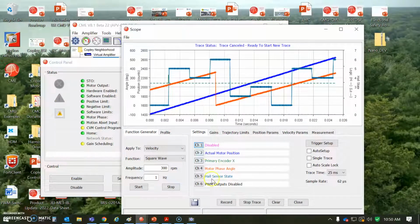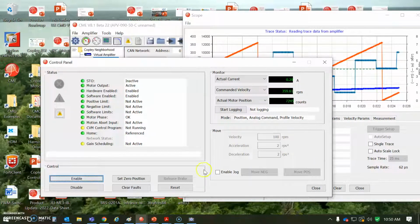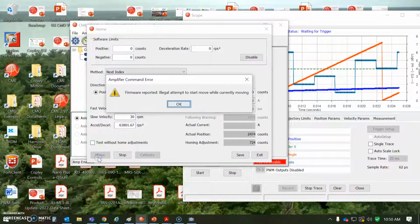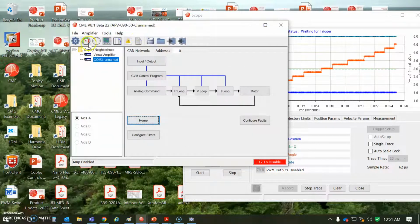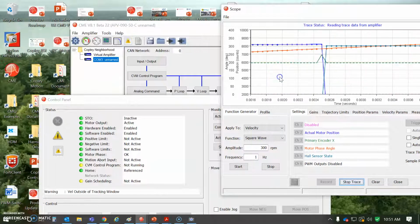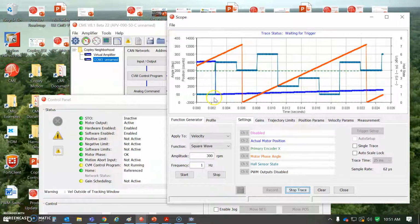And again, I've been tracking the index pulse. So right now it's working from the 0 position, which is good. And so for the troubleshooting of the index, what I do is I do the homing, and I'm going to have to do this twice, but I go to the index pulse for 0, so I'm all lined up, and then re-enabled and commanding speed. I'm just going to monitor this index pulse. It's really narrow, but I'm triggering off of it. And then you can see the Halls decode in a logical manner. And then what was happening over time is I was drifting away from 0.